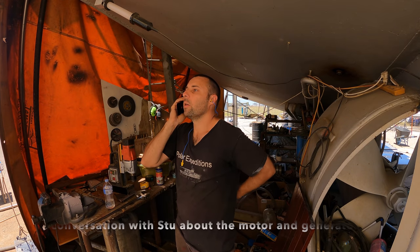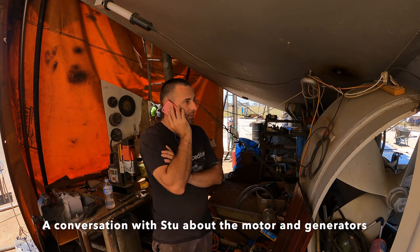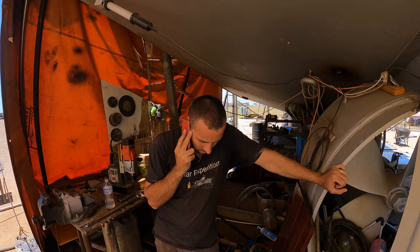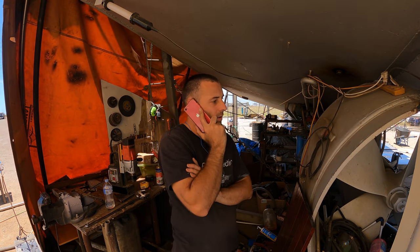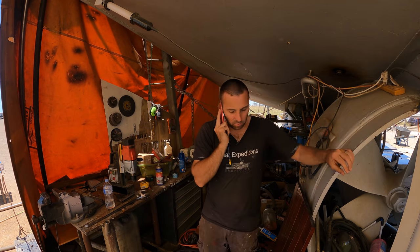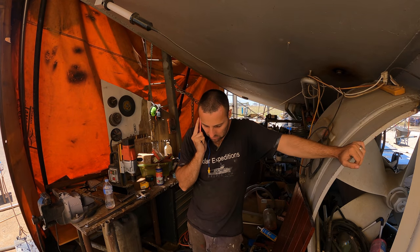Oh, okay. Well, originally that was just for the steering. So we were only doing, I think, 5 gallons a minute or something. It was pretty small. We're probably not going to be running oil in Antarctica. So in order to run in our engines, we have to heat the oil up to 76 degrees or more to get the same viscosity. But we start up on diesel and stop on diesel.